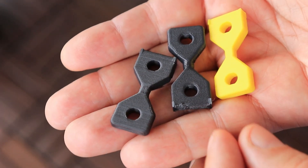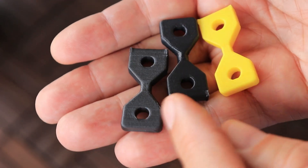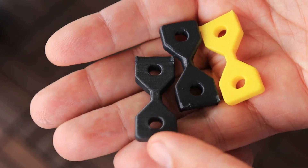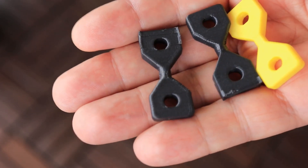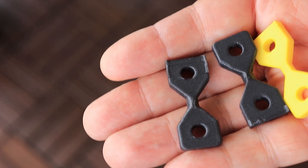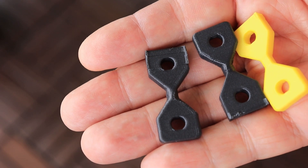It's printed but the smallest cross section area is not nicely squared like with PLA and regular cooling. The reason is that without a fan the layer printing time is very short and it doesn't have enough time to cool down. It would be much better if I had at least 10 pieces at a time so the layer would have more time to cool, but it's printed and I will test it as it is and I hope I will get much better layer adhesion.